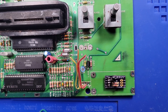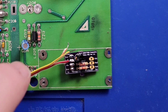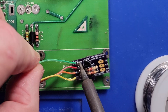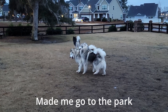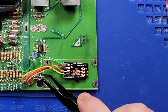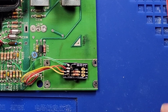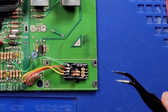We have to attach the green wire — which is going to be audio — to R206, which is the fourth resistor up. We've got solder on our pads, so it's just a matter of connecting the wires: red is video at pin four, yellow is ground at pin one, orange is five volts at pin three, and we're pulling audio off the top of R206 sending it to our printed circuit board.